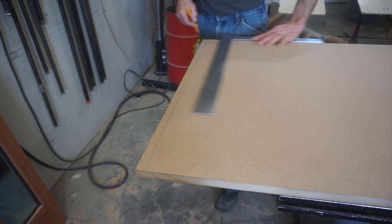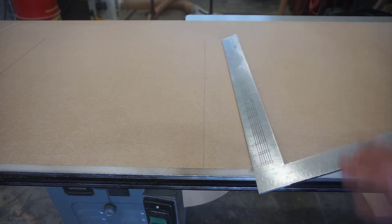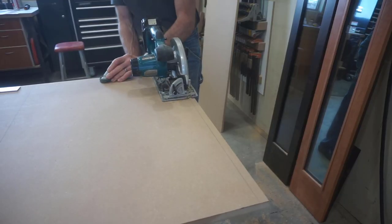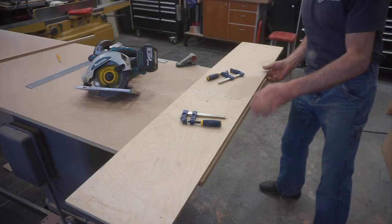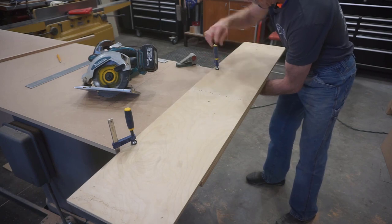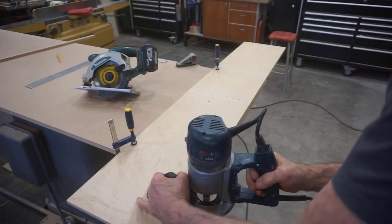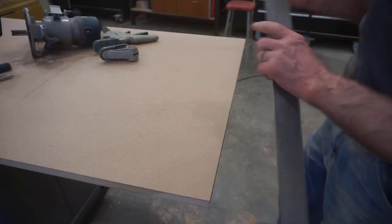Because this door is only going to be as square as this panel is, it's imperative that my framing square is right on. I'll show you the oldest method in the book for verifying if a square is square: start out by verifying you have a perfectly straight edge to work from, place your square along that straight edge and draw a fine line along one blade, then flip the square over and draw another fine line along the same blade. If the two lines line up, your square is square. Because the roughness of a saw cut isn't acceptable for this panel, I'm going to freehand it and flush trim it with a router. I'll use a piece of half-inch Russian birch plywood as a straight edge, carefully line it up on the square marks, and clamp it in place. Then using a half-inch shank top-bearing flush trim pattern bit, I use the straight edge to true up the edge of my door panel blank.